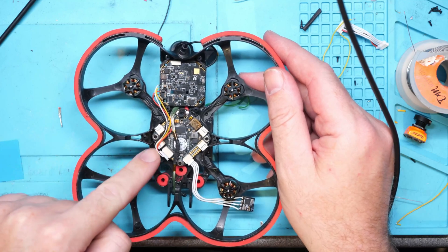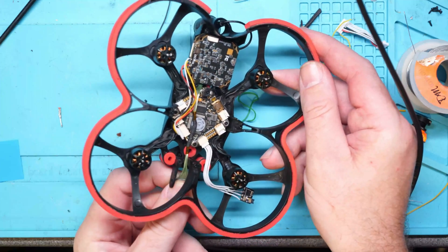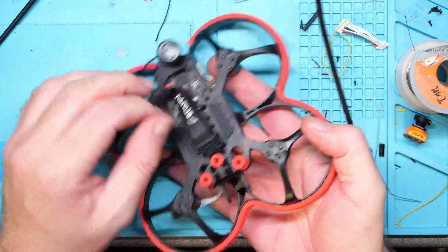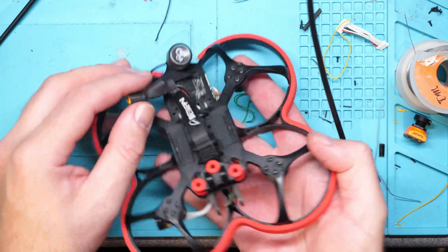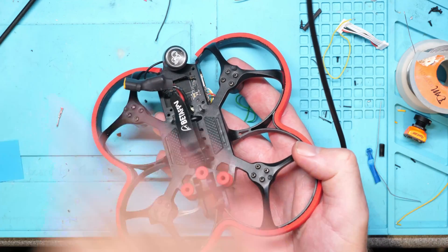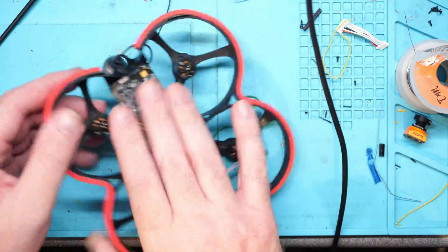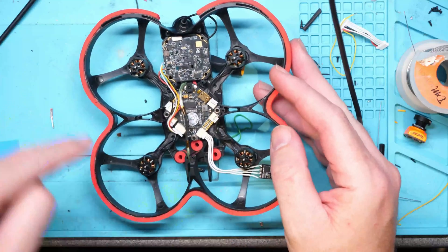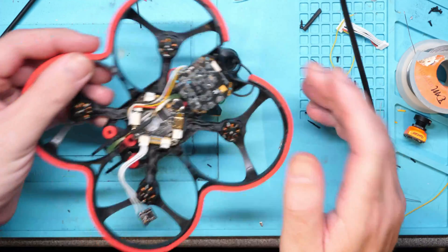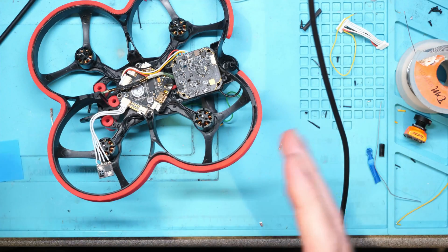I've got the VTX in place with the wiring connected. We've got the MIPI cable coming over — it is a little bit tight. I have a longer one I may be able to use, but I'd rather keep that for another build. I've also got the antenna on; this is the antenna off the Vista. I just realized I don't have any UFL right-hand circular polarized antennas, so yes I'm going to get a 3 dB loss on that — I'll deal with that later, this is really just about getting it up and running. I do need to do a firmware update on this VTX before I button it all up, because there is new firmware out. I'll do that first and then we'll get it up and running.